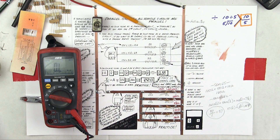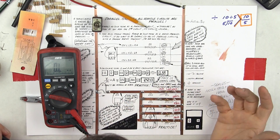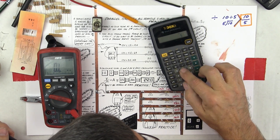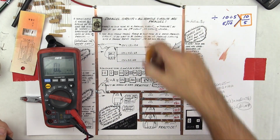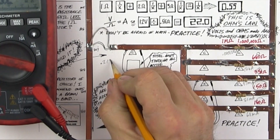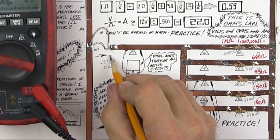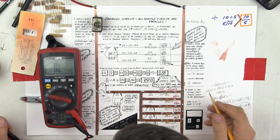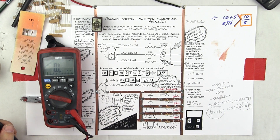We calculated about 0.22 amps. More precisely, 12.25 divided by 58 equals 0.211. So I'm expecting about 0.212 amps, which is 212 milliamps total through the whole system — this plus this plus this plus this plus this. So that's going to be about 0.212 amps.